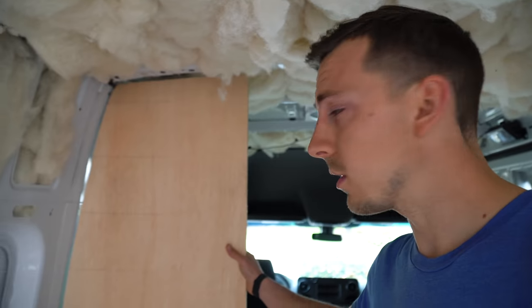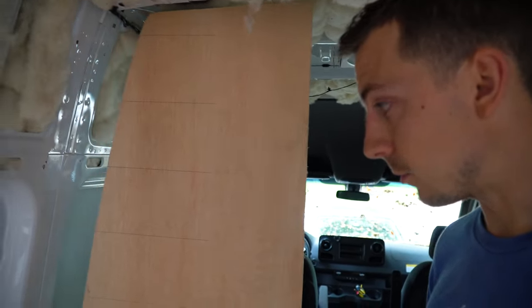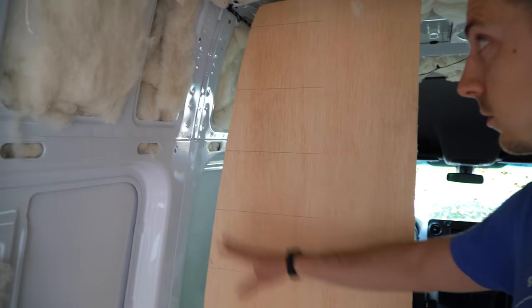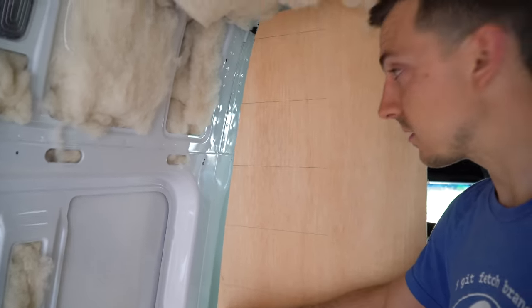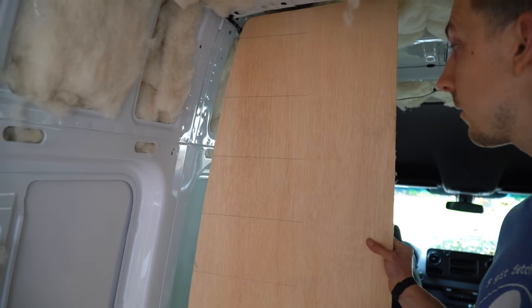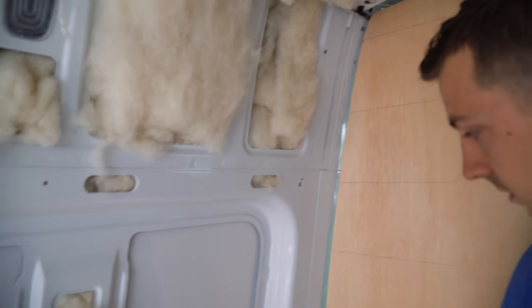So the weather cleared and we finally have some action. Very exciting. What we've done is we came in, brought in a piece of plywood and made a template for the bathroom walls, which is what we're working on. This was a little more out here like that because it was square. And so we took measurements all along the way at like six inch increments, and then took it inside and cut a little bit off of it at a time. It took a few back and forth tries, but this template fits really nice all along the way, as you can see.